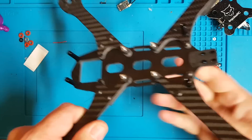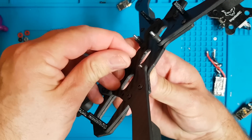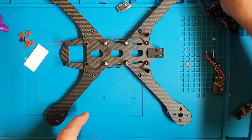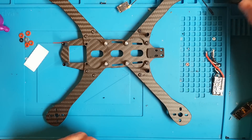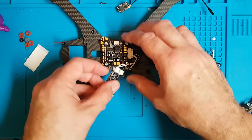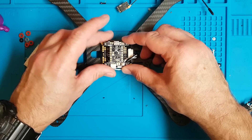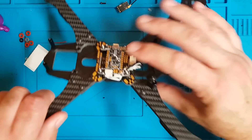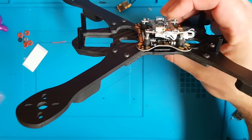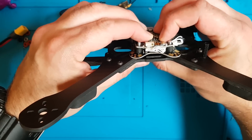Because the CG has such stiff arms, I've basically just not bothered with a nut here — I've simply screwed these on. You could use longer screws and a nut if you wish. One quirk of using the Wolf PDB — and I'm presuming this doesn't apply with the Reverb — is that if you put your flight controller on the quad like so, you'll notice immediately that you'd want to connect your battery wire here, and the flight controller sits too close to the Wolf PDB to do that comfortably.